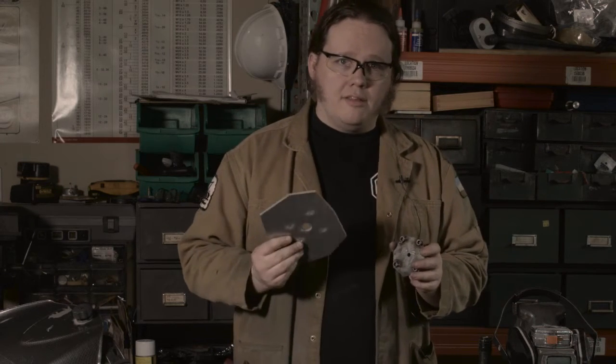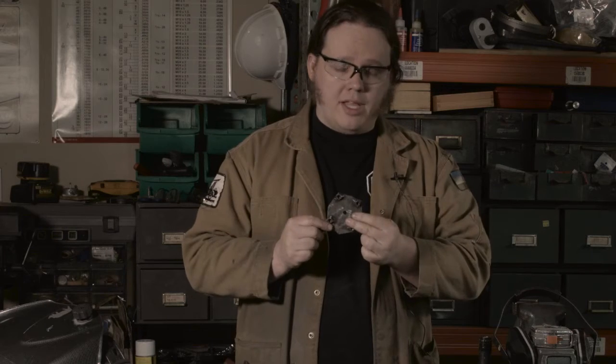And to do that, we weld 4 nuts onto the underside of the top plate. But of course, those nuts have to be aligned in the same way as the holes on the plate. If they don't line up, they won't screw into each other. So how do you guarantee that these nuts are in the right place every time? Well, to do that, I made an alignment jig, which is what this ugly little X-Wing fighter thing is.